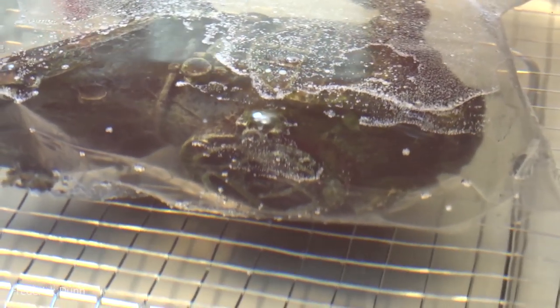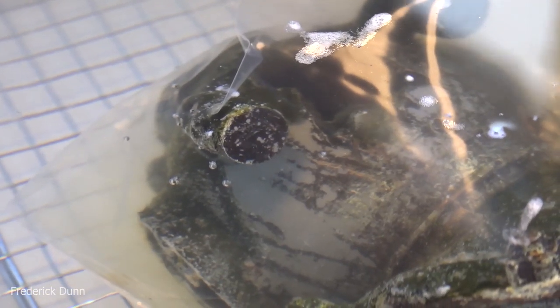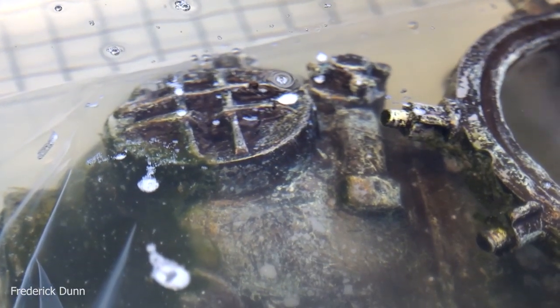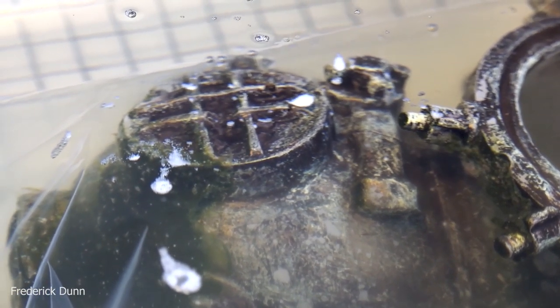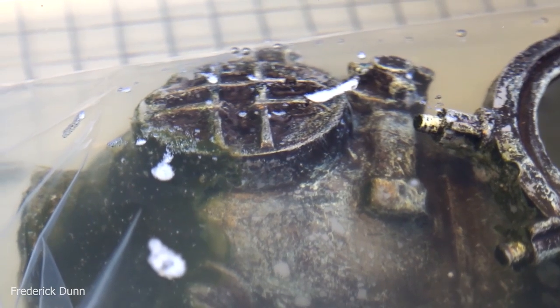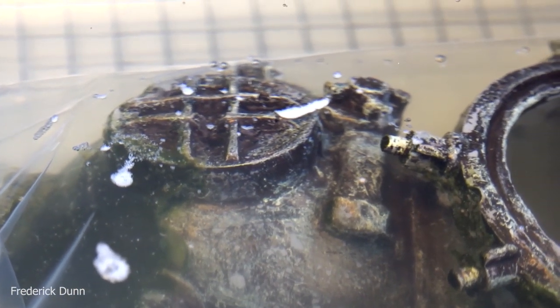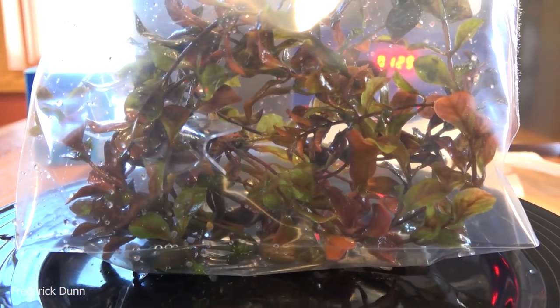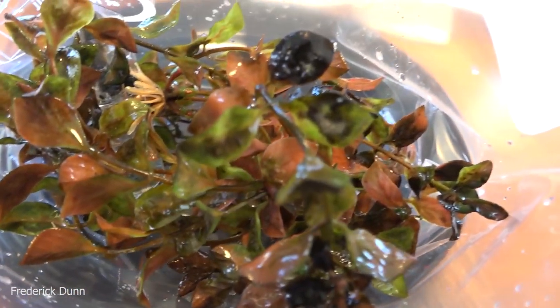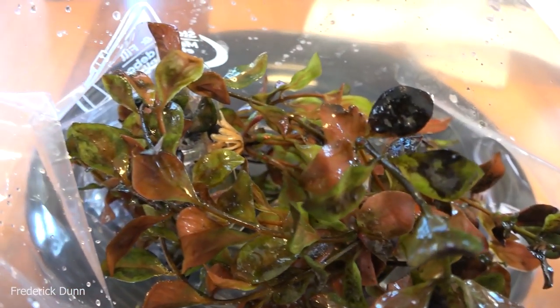Right now inside that bag we started off with just water, and you can see micro bubbles traveling. But the bubbles really doing the work are microscopic — you don't actually see them. Where the ultrasound impacts the surface of the dive helmet is where cavitation takes place, and that's where it starts to break away anything attached to the surface. Here's one of the plastic plants — if you keep tropical fish or have plastic ornaments underwater, they tend to get grit, grime, and algae into the tiny details.